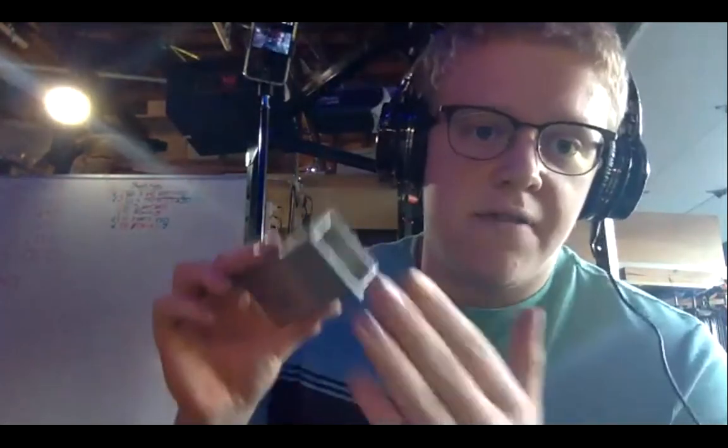especially since our end mills aren't very sharp and we should probably get new ones. But besides the point, if we do a falling cut, the end result, the end finish is going to be pretty nice. So that's what we strive for, especially when we want something that can be perpendicular and completely flat in terms of its side profile.